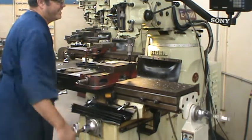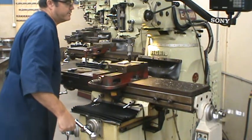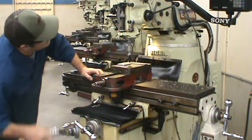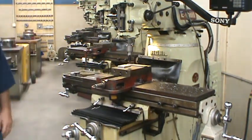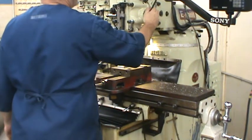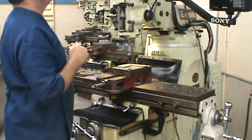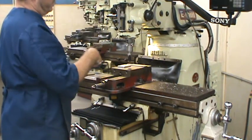I'll use this part of my vise and hold the part by hand. I'm going to bring the spindle over the center of that hole — I'm really close, but I can barely get my part under, so I'm going to give myself a little more clearance by bringing the table down. I'm going to make sure I'm in low gear and adjust my lever for mechanical advantage. I'm going to use the reverse setting so my spindle rotates clockwise for a right-hand tool.